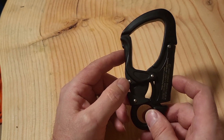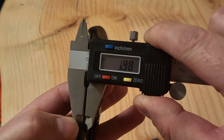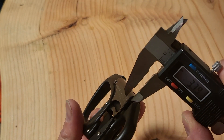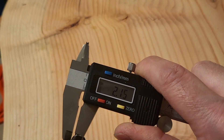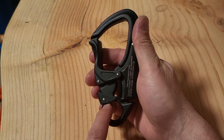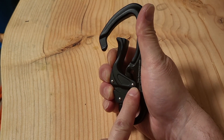Let's go over the new design. We're going to measure the third catch — we're about 2.01 millimeters, give or take. And then we're going to measure the second catch — we're about 2.15 millimeters. So basically what that means in a nutshell, the second catch metal is just slightly thicker than the third catch metal. So as they start to wear, the third catch won't have the ability to slide over top and lock the gate in an open position.